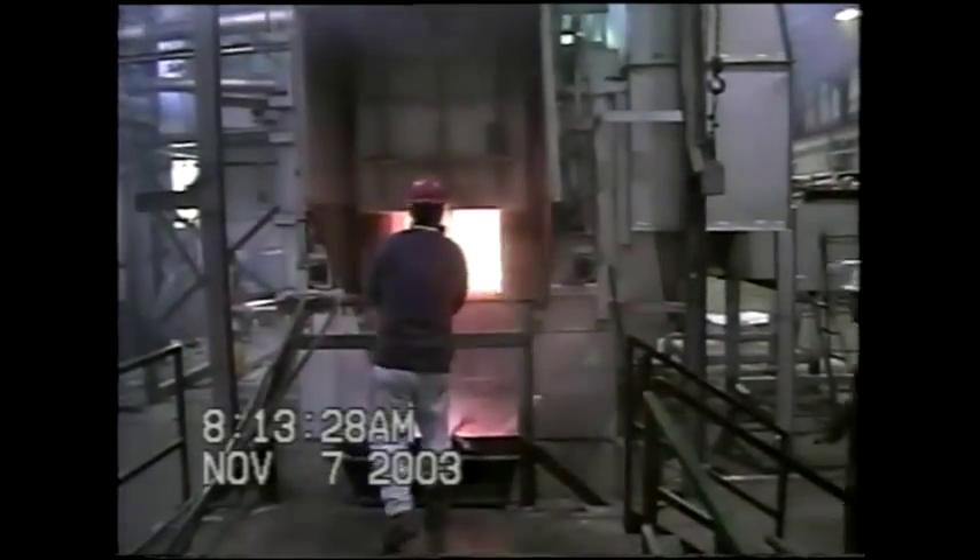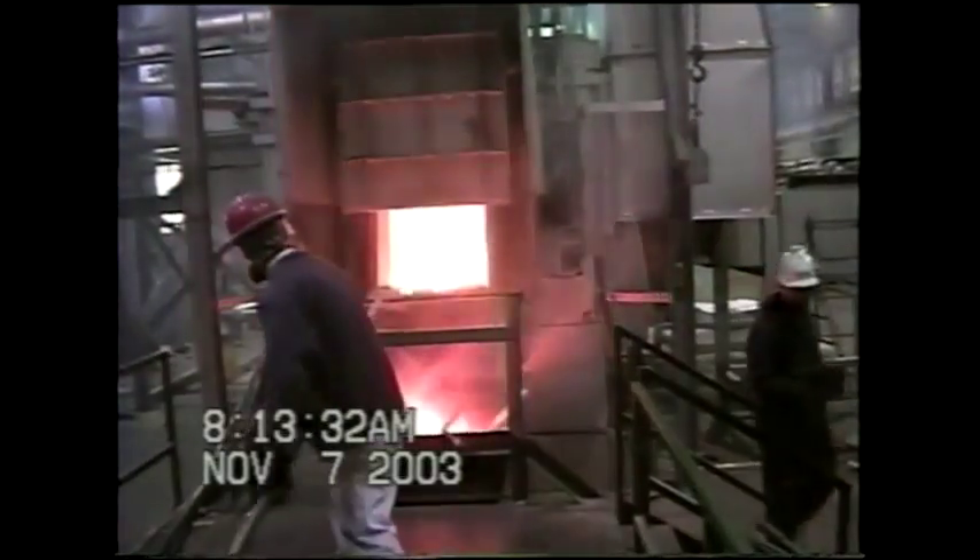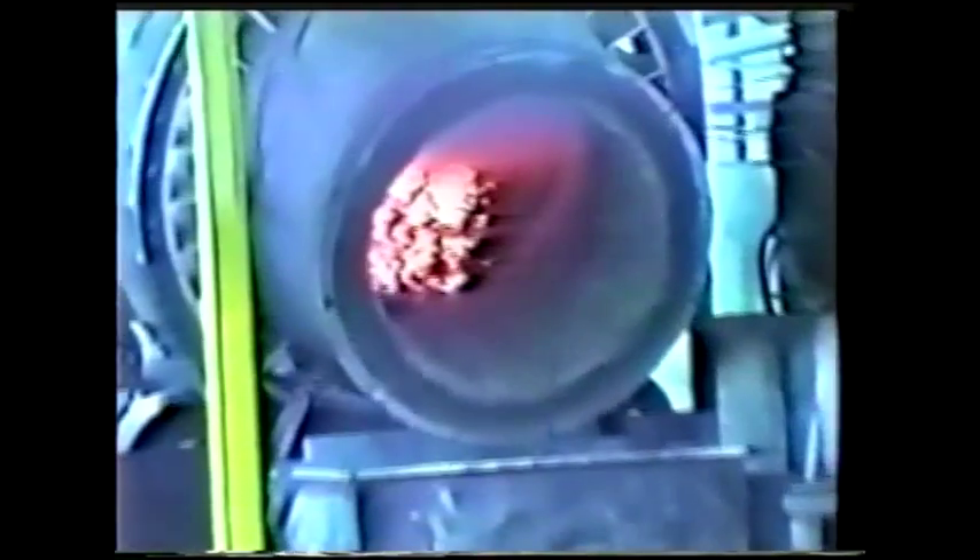Avoid the hand labor as seen here in the video to slag off your furnaces by pouring only clean melt into the furnace. These are built from a rotary furnace that holds slag in its barrel to be swiveled to a slag off position and disposed of.